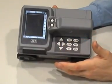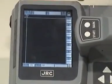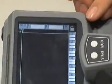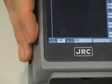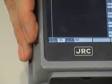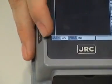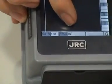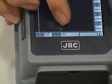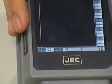This is the normal scanning screen. In the top right-hand corner we have a battery indicator — at this point the battery is about 75% full. In the bottom left-hand corner we have the gain setting, which is the amplification from the different levels in the concrete. There are six options for the shallow setting and six options for the deep setting. There is also some processing available, which we'll talk about later — in most cases you won't need it unless scanning on tiles or when having trouble finding the depth of a target.